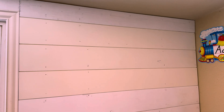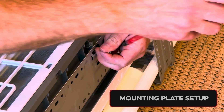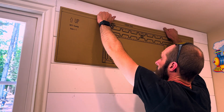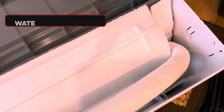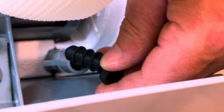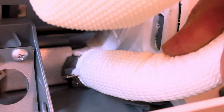The back of the unit has a mounting plate pre-attached. You take off one screw, it comes loose, and then you use that and the template to figure out exactly where you want to place it. I put a couple of nails in place just so I could hang the bracket and know exactly where it was going to go. Next you have to bend the tubes 90 degrees — it's a bit scary but it works; just go slow and don't kink it. The water drain pipe is always on the wrong side, so you unhook it, slide that little hook, pull the plug on the opposite side, slide the tube back onto it, and replace the plug on the side the tube came off. This way your drain and copper tubes come out on the same side.